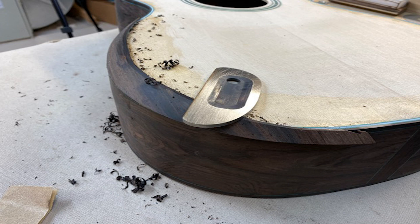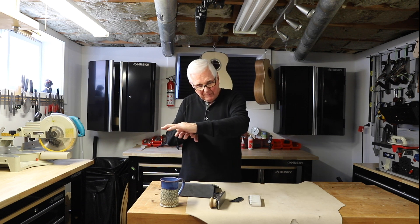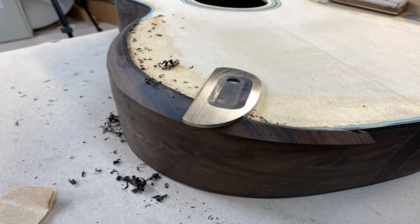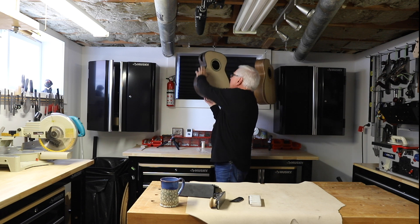Sometimes this gets a little brittle and rough so I just sand it a tiny bit so that the blade from the scraper will work well. I'm also very careful about using the plane — I will use it to come around on the top, but you don't want to tilt it because you don't want to score the top. You've got to work from the edges in.